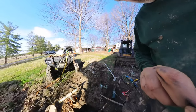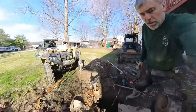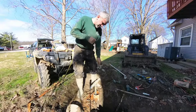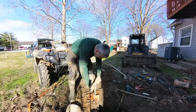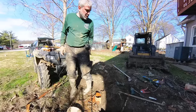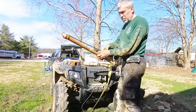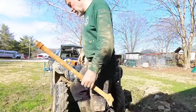We got our line in, and now we're going to take out the T-handle, figure out our length that we need, and see if I need to add anything. I looped it like that so I could pull it out. Had I just tied it on down there, then we would be able to just do this. But that's why we did that. This is seated great, not moving when I do that. Unscrew this. I'm going to measure this. From threads all the way in, it's 29 inches. So let's see, threads all the way in, 28 inches. So looks like I am an inch different now.